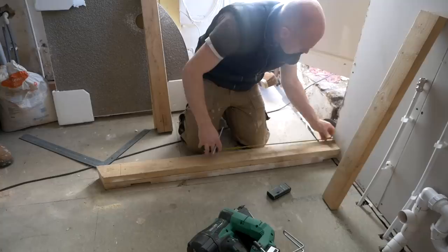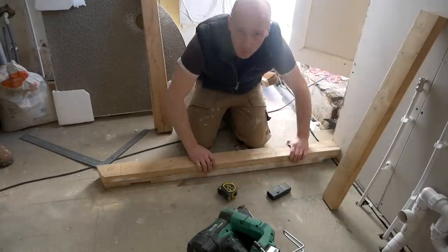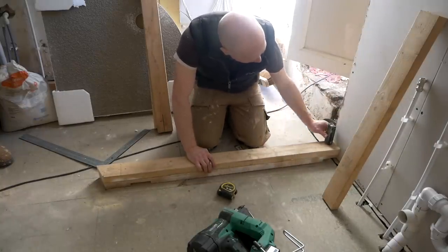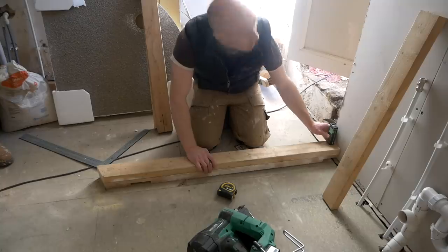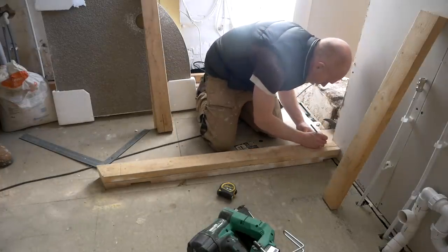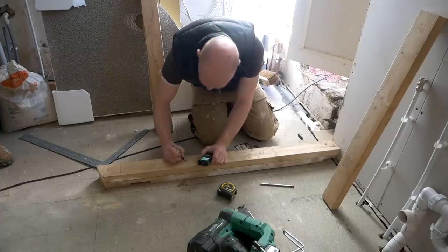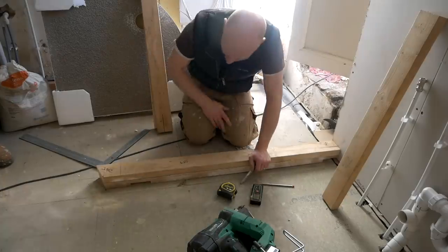So I'm going to try something new, measure our studs out. Put those two there, that'll account for the top and bottom. And if I use our laser and sit it on top of those two, about halfway across where the stud will be, providing it's hitting the insulation. So that's 2191. 2175. 2159. 2145. So there are four studs, we're going to cut those.